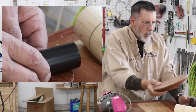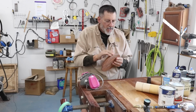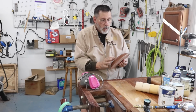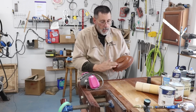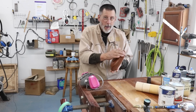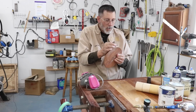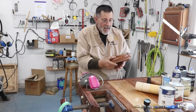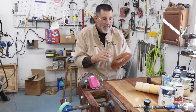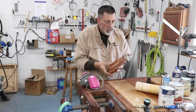And I opened up the video with this particular little bowl. One mistake I made on this that I point out in the video was I wiped on the lacquer here, and I later on kind of buffed that with a paper towel. Well, I just totally destroyed the surface with a bunch of little bits of paper towel in there, and I actually had to go back with my texturing tool and redo that. And then, so, you know, maybe a cloth if you do it safely.